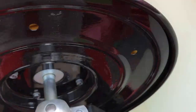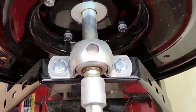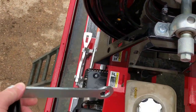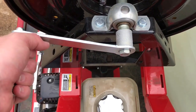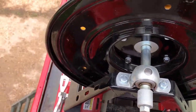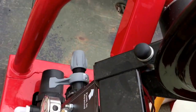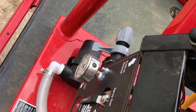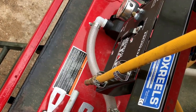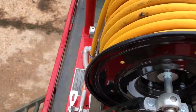The hose has already been burned on the exhaust, so it looks a bit rough. If you have 100 feet of hose rolled out, you'll need a way to roll it back up. There's a hidden spot right here — that's your handle to roll the hose up; it goes on just like that. It does have an electric reel on it, but it's not wired to the battery. Remember, this is a 24-volt system, so to make that work we'd need a 12-volt battery or wire it for 24 volts. We don't use it enough to justify hooking the electric reel up.